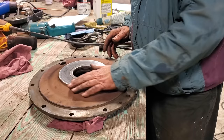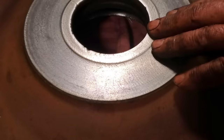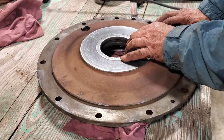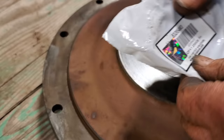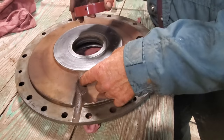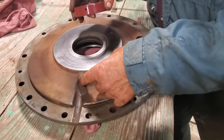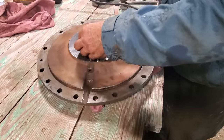The reason for cleaning this up is to try and take the groove off so that the brake will not wear in as fast — it will last longer. Now we need the seal. The seal always goes towards the oil side. This is the new seal, part number 832-935-54M3, and that's been the same seal for a long time. You'll see there's a hole in the bottom and it's best if you line it up with the drain hole. You want the lips towards the oil, and the oil is on the bottom side, so we're going to put the seal in from this side here.